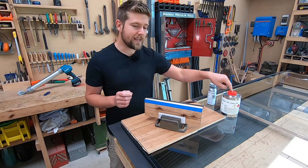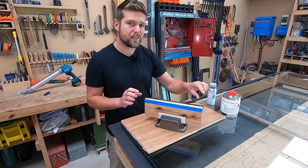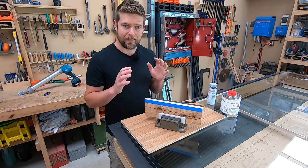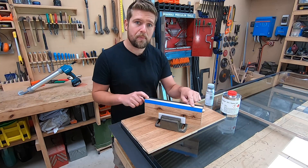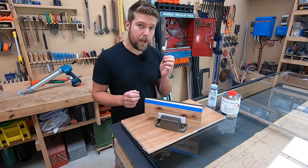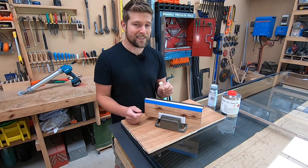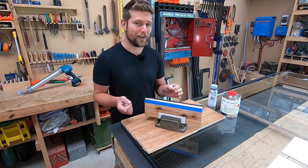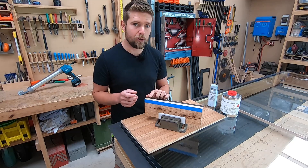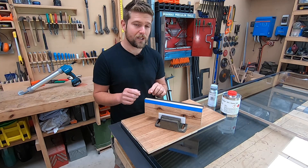The first step in the bonding process was to hit it with Sika Activator 205 - that's basically an alcohol-based cleaner which makes sure the surface is completely clear of impurities, but also has additives that aid adhesion. I applied that, cleaned the surface, and let it flash off for about 10 minutes. Next I primed the brass using Sika Primer 210, which was key to getting the adhesive to bond onto a non-ferrous metal. I used a woolen swab to wipe the primer onto the brass. This stuff starts setting almost instantly so you have to get coverage right as you move around because you can't go back and touch it up. I then waited for it to flash off - about 30 minutes depending on temperature - until it's no longer tacky and ready to receive the adhesive. There's a maximum working time of about 24 hours, after which I'd need to re-prime.